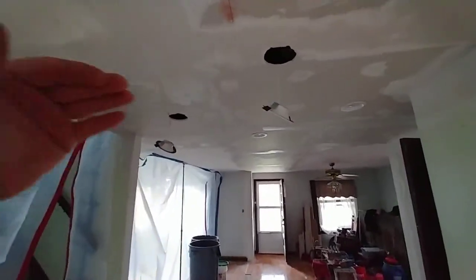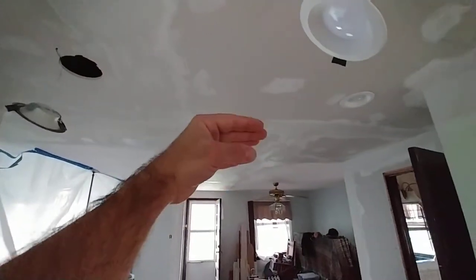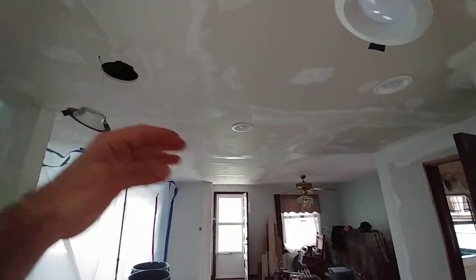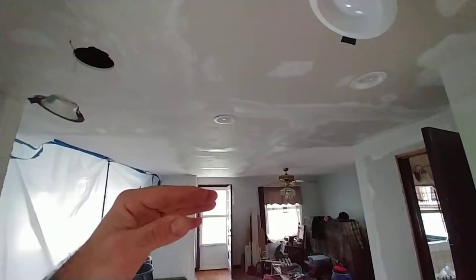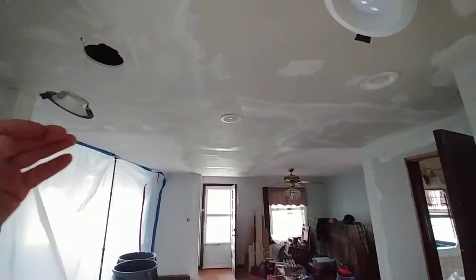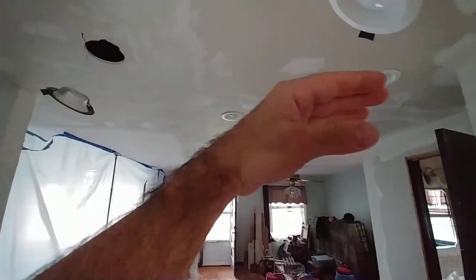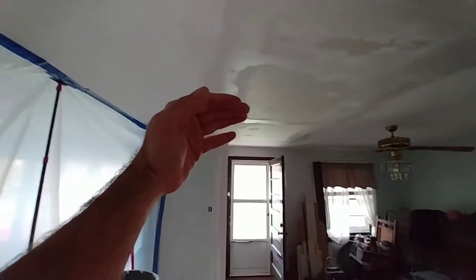We're going to be really careful of that. Basically the fill shouldn't be a big transition. It's hard to see because we shimmed down the drywall to get as close as we could to the existing surface. Ultimately we don't want to be there or any lower than that, because then our fill is going on the high side. We wanted to still fill on the low side, which is the ideal scenario. So most of our mud today was on the new drywall side of the joint.